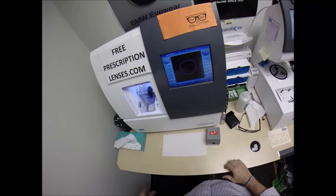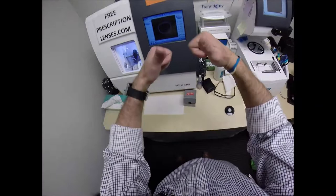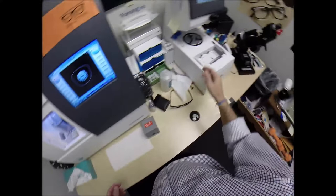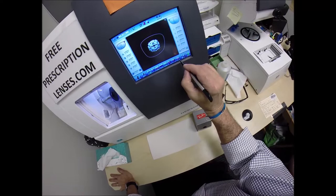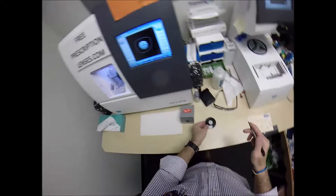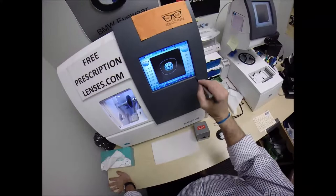So you get to see something different. This is the edger — it costs $40,000 and weighs 200 pounds. These are polycarbonate lenses; if they were plastic, high-index plastic, or Trivex, which are different materials, I would select that. I'm not going to polish the edge of the lens because it's not going to be seen. I'm not going to put a safety bevel on the front convex surface nor on the rear concave surface because these are sunglass lenses — when I do a safety bevel there's a white ring. I'm going to cut this on the manual cycle and manually place where the bevel goes.